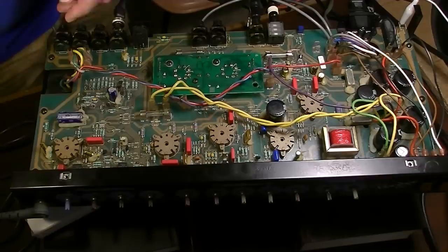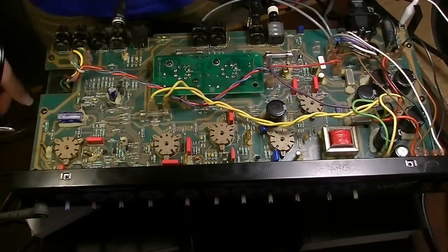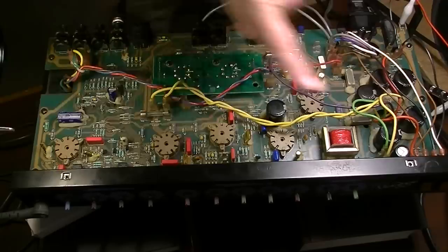But that's what I'm using, because that's what I've got over here at this particular house. Now, you don't have to have a lot of really sophisticated equipment to do a simple signal trace. And when I say signal trace, I just simply mean following the path of the signal throughout the amplifier to see where you might be having problems. So here's what I've done to set up a signal trace. I've got my probe, which is leading to an amplifier that's here on my desk. You can't see it, it's off camera back over there, but you'll be able to hear it though.